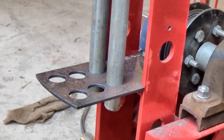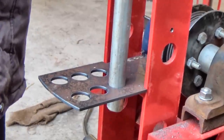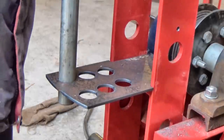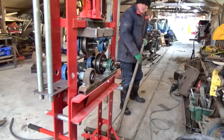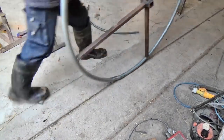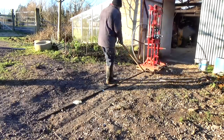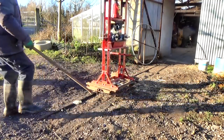I thought it needs guides that keep the pipe in line as it enters and leaves the frame. So I made a bracket with holes in, and the holes take vertical pipes. I made pairs of holes so I can accommodate different width pipes. Because these are tall, they should support the pipe even as it becomes more curved, and keep the pipe and the dies in one straight line right through the machine from one side to the other. It should have worked, shouldn't it? Except it didn't.